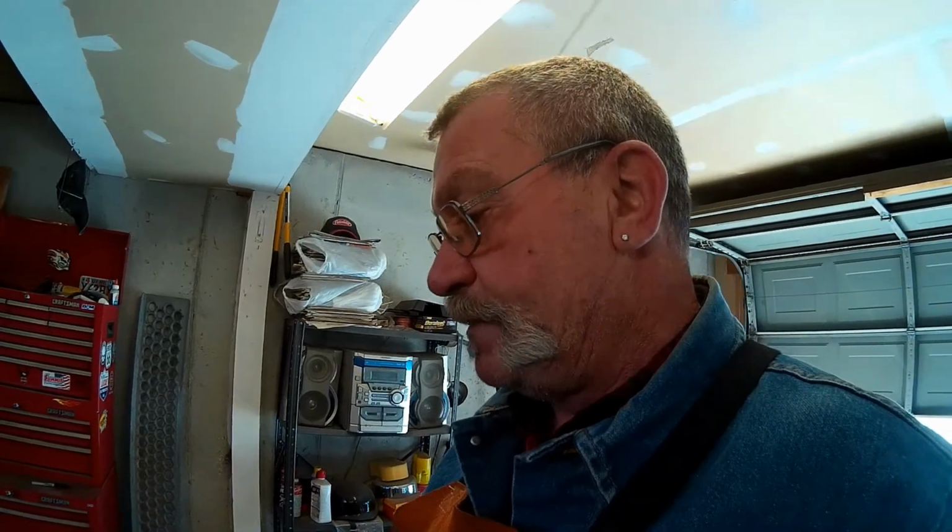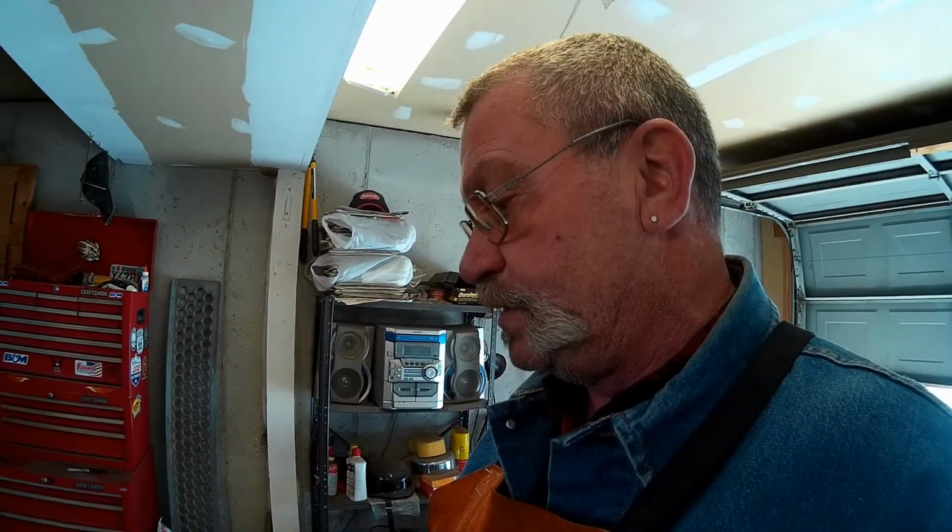as you pound on it, where it was welded, it will harden up somewhat just from work hardening. I dropped my hammer on the other side yesterday where I welded it, and it's got pretty good rebound where it was welded. So I'm not real concerned about it. As far as its value, maybe as an antique, I have no idea how old this anvil is. And even if it is an antique, that doesn't mean it can't be restored back to its former glory. It's never going to be like a brand new anvil, but it's going to make me a good usable anvil for my shop.